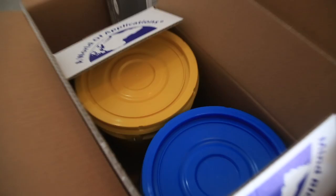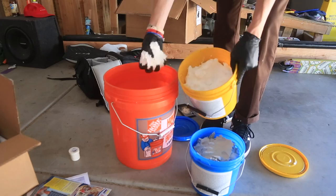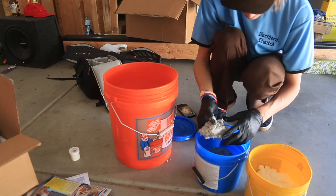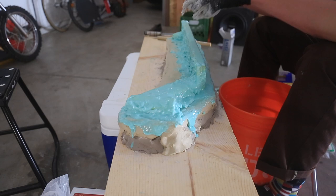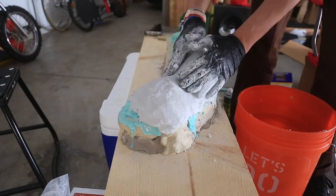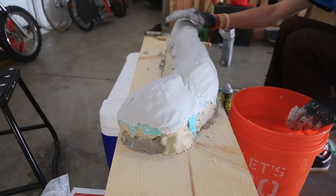I'm going to cover it and then put more silicone on it — just watch the process. Like the silicone, this is a one-to-one ratio mix. I'm only using half for the first layer because I can do two separate coats on the scooter deck. Right now I'm spraying so that way the outer coat won't stick to the actual silicone. Now I'm just applying the mother mold — the free form air — to the silicone and placing it all around. It kind of feels like Play-Doh and it's really cool to form. I would highly recommend using this free form air if you plan to do something like this.